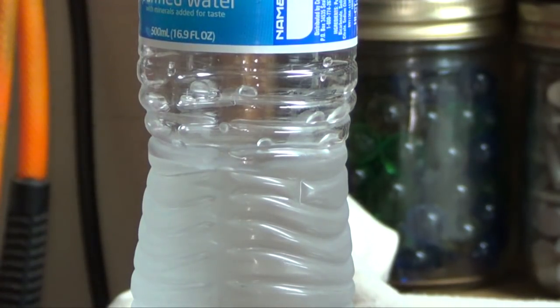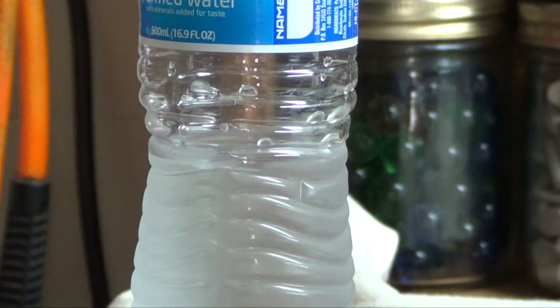So there you go. I know I've got the back plate in balance with that slug I put in there and then just drilling that out. That was 5/16 that I went all the way through on that little piece. Alright, I guess I'm going to take the chuck back apart, do some maintenance and cleanup and say good enough, and see how the finishes come out on it. Hope it helped somebody.